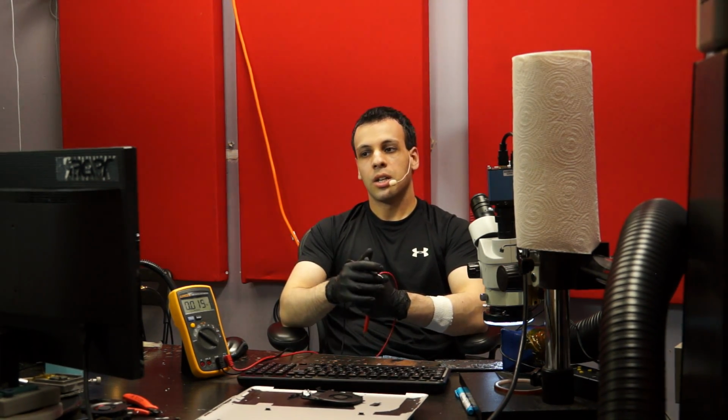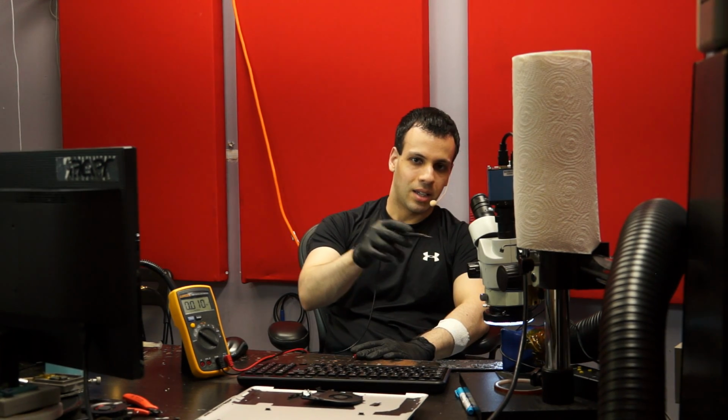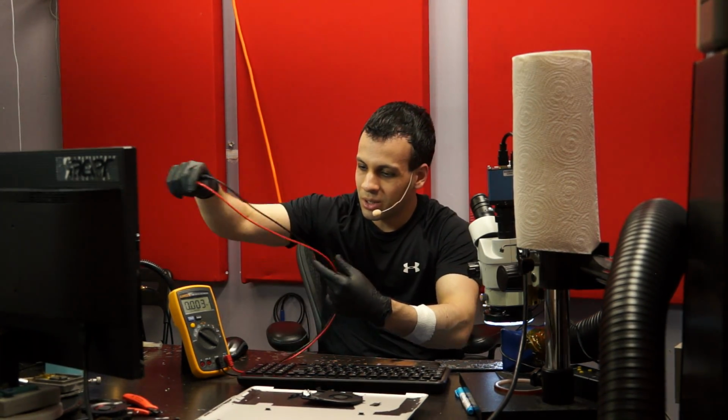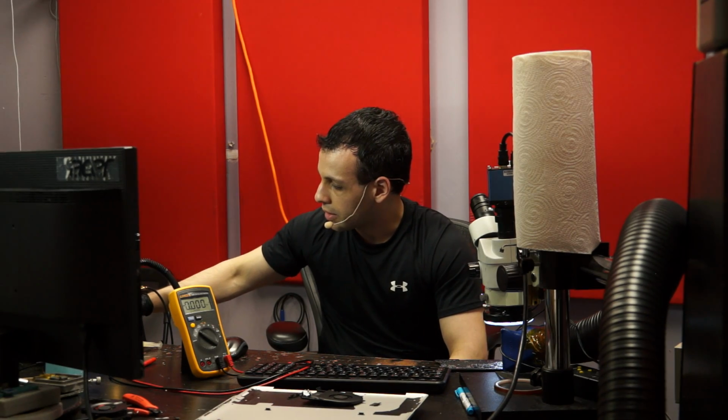Most likely the chip. There is a very small chance, and I say small chance because I got trolled with this in an earlier one, that the SMC itself is bad, and the SMC itself being bad is what's pulling down SMC Reset L. But usually when you see SMC Reset L being pulled down, particularly on this circuit with this U5110 chip and this SMC, you're going to see that the SMC Reset L signal is something like 0.574, 0.581, somewhere around there. So since we see 1 volt, I kind of feel like I got a different problem here. Because often when these things fail, they fail with kind of patterns.